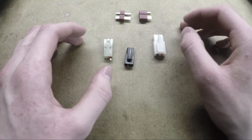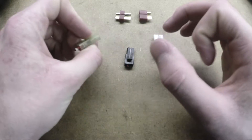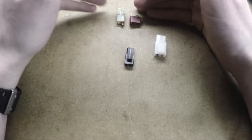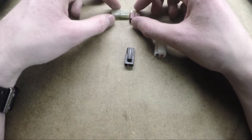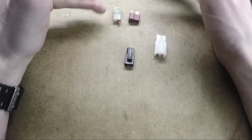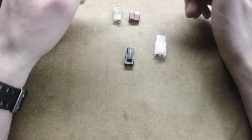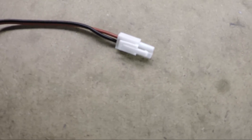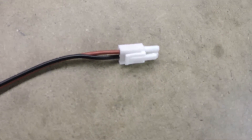There are other characteristics of the Tamiya connector that make it not really the best choice. First, it's considerably longer than the Dean's connector, and this makes it difficult to install in a smaller space, for example like a buffer tube, where you really don't have a lot of room for a bulky connector. Even if it's a small type, it's still quite a bit longer.